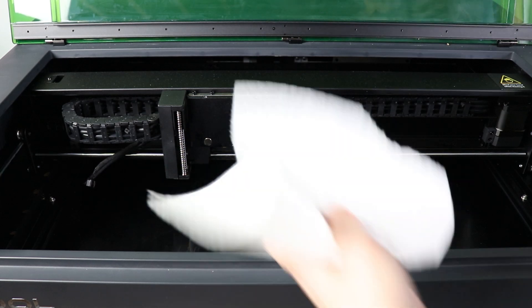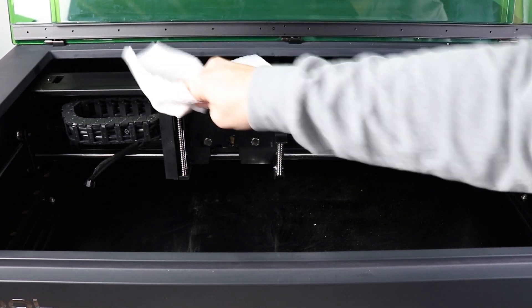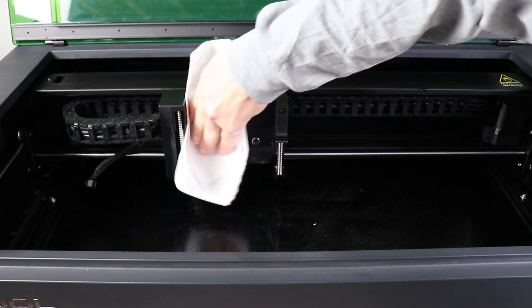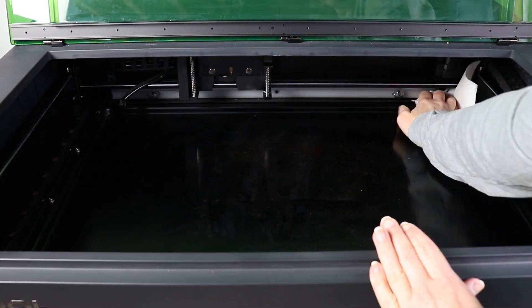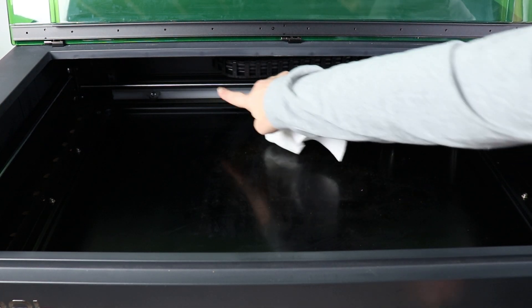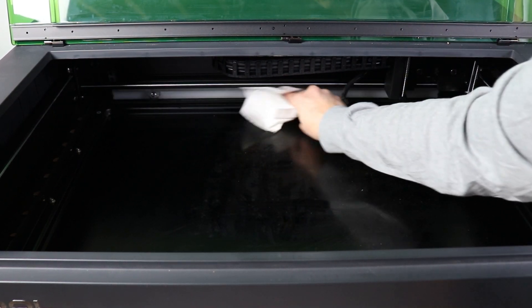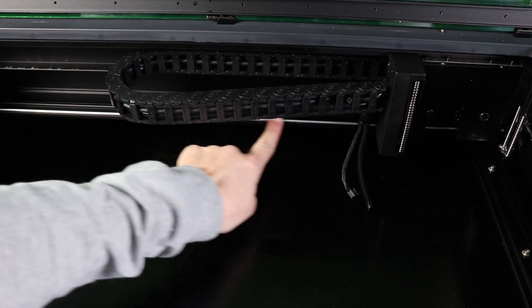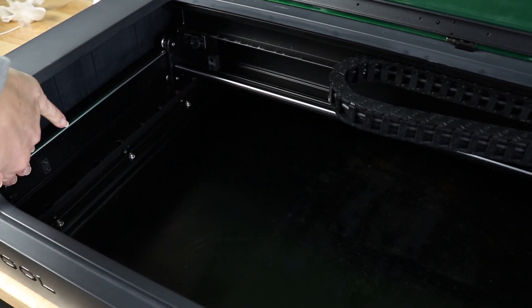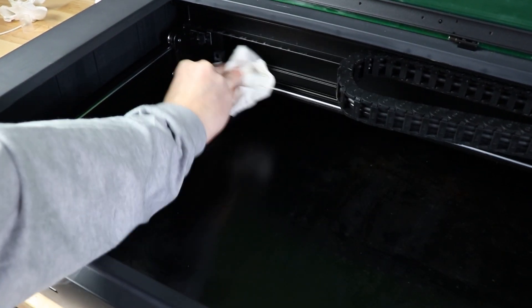With the laser module off, I am just going to take some rubbing alcohol on a paper towel and clean everything inside this machine, focusing on getting any dirt and debris off that would hamper my laser. In the back over here is kind of where the fan comes out, and I've got a good amount of dust that collects down there, so I really want to focus on that area too. We really want to focus on these rails here — there are two sets of rails, one that goes across and ones on either side. Make sure you're taking your cloth and wiping those down really, really well, and then we can lubricate them.